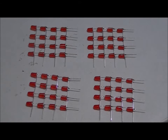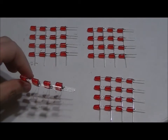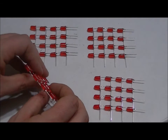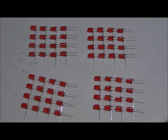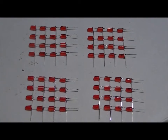After you've tested all of your LEDs, it's time to move forward. Now you might notice, after you're done looking at some of them, they might not be 100% horizontal as you'd like. And depending on the quality of your soldering, you might feel confident enough to just give a little bit of a bend to each of them to make it a little bit more horizontal. And after you do that, just in case, you might want to check the LEDs one more time to ensure that you haven't broken any solder joints. You don't need to do that. My four LED rows are pretty good. They're not 100% perfect, but it's hard to get perfection, unless you're willing to spend hours and hours making every single solder joint 100% perfect. Again, the quality of the cube itself is completely up to you.